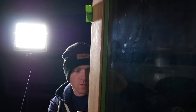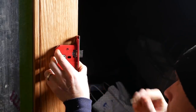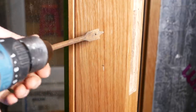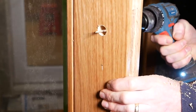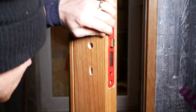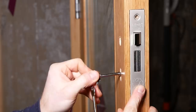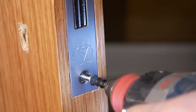Another coffee later and we're on to getting the holes drilled for the key and the handle spindle. Once I've got the lock in place, I take it back out, hold it up to the side — remembering to account for both the lock itself and that plate — get those flush, and then mark those two holes that need drilling. I marked this on both sides because drilling from both sides gives a better finish and less chance of tear-out on the wood. After a bit more cleanup, I checked everything was moving freely before putting in the two screws to install the lock.